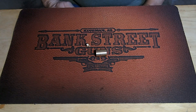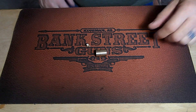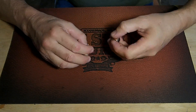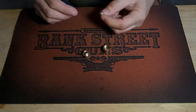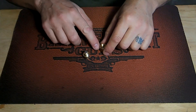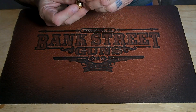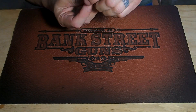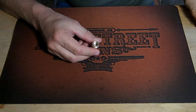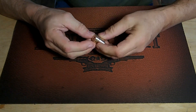Some people on eBay try to sell you a module already assembled and say that it's pressed in and all that, but there's no pressing with these here. It simply just drops in, actually. This is a nine millimeter diode — it goes in like that and drops into the hole right there. The assembly is as such, like this. Just twist together, and that's it. Now, you have to put some thermal compound on it, but we're showing you how it fits in there first.